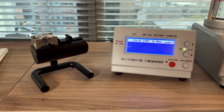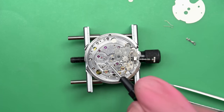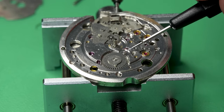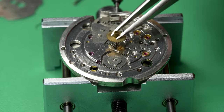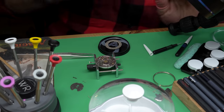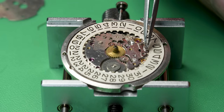Now that we've got it all oiled up, let's put it on the time grapher and see what kind of results we got after some tweaking. Oh, very good — solid amplitude at 231 and zero beat error, and it's within one second a day. So really, really nice. I mentioned that this watch has 30 jewels in it — that's a lot. Normally a nice Swiss movement will have 17; that's kind of the baseline. But this one has 30, which means they put a jewel on any friction surface they could get their hands on. It makes things a little more resilient, runs a little smoother, maybe runs a little longer even if you don't take perfect care of it.